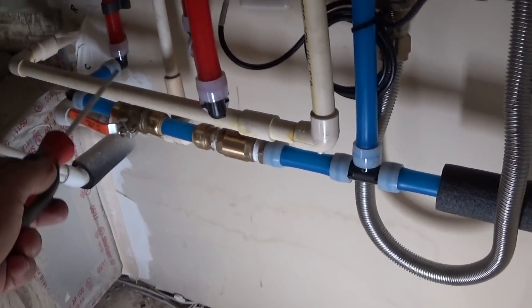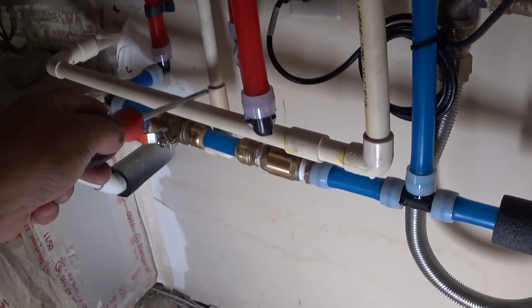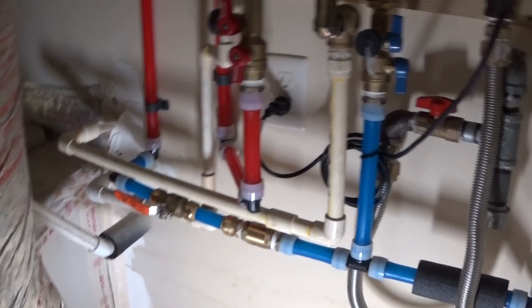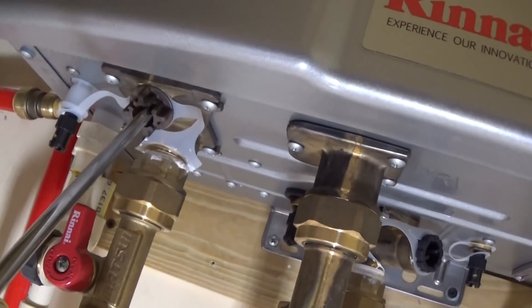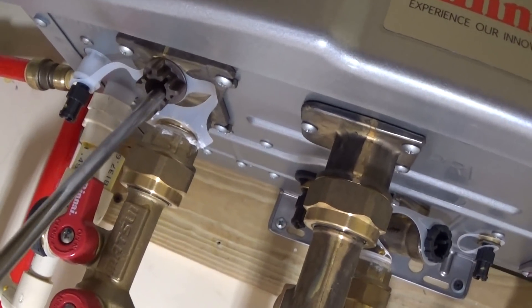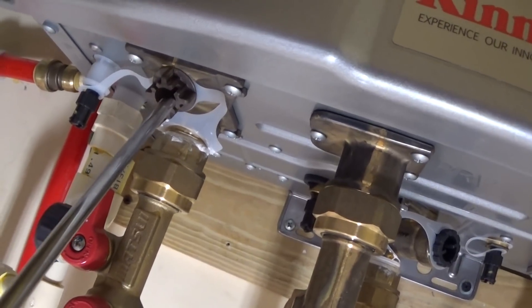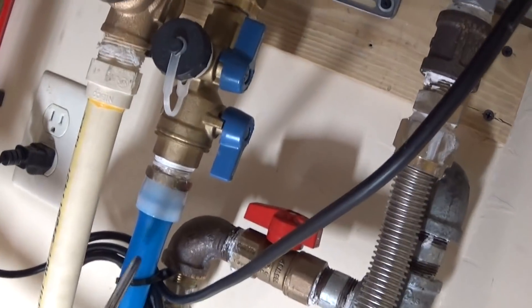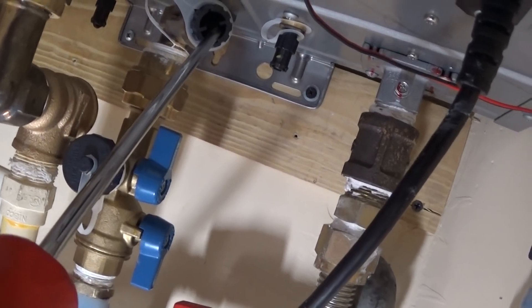If you're going into a sewer or a sink, you need this to be a one-inch air gap. But since we're just going down, we put it into the three-quarter pipe and that drains down to the outside. Here is where the plug is, or you would take this out to put the filter in — that here is the filter, so the incoming cold water has a filter. And back there is the bleeder that will bleed the cold water side.